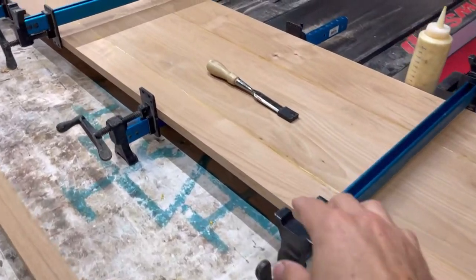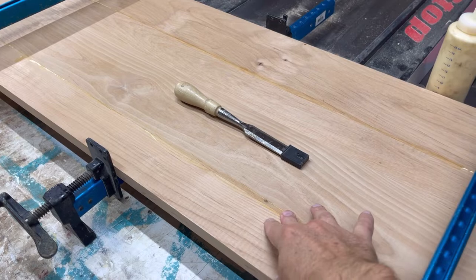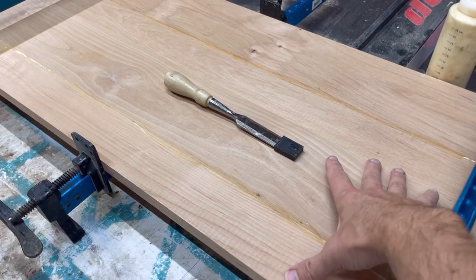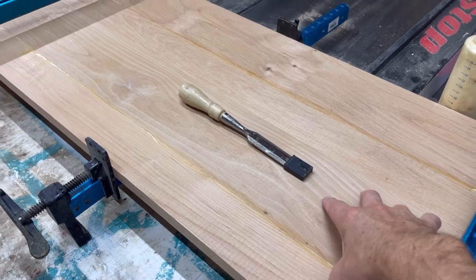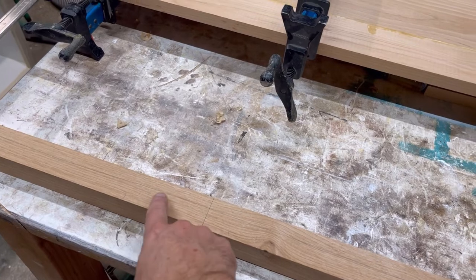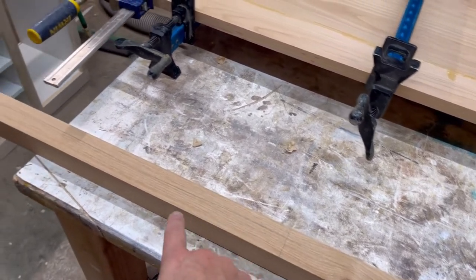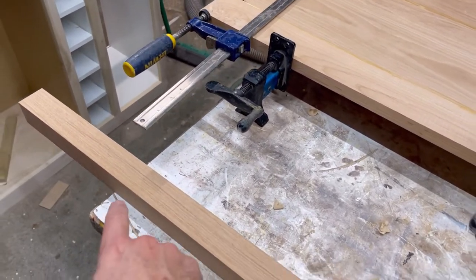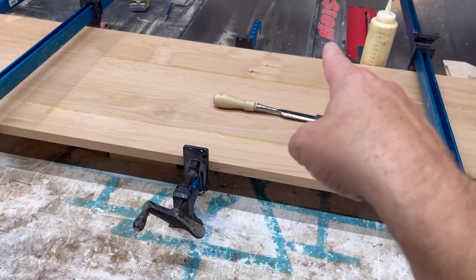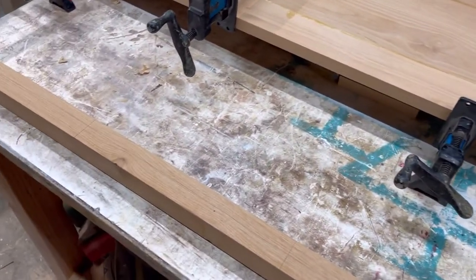I have more wood now, and I've glued the larger rail pieces together so they'll be eight inches instead of five and a quarter. Now that I know the final rail size, I can finish my layout because I'm going to have to make a jig for the tapered portions. That jig will clamp everything down and I'll be able to run it through the table saw to cut those tapers.